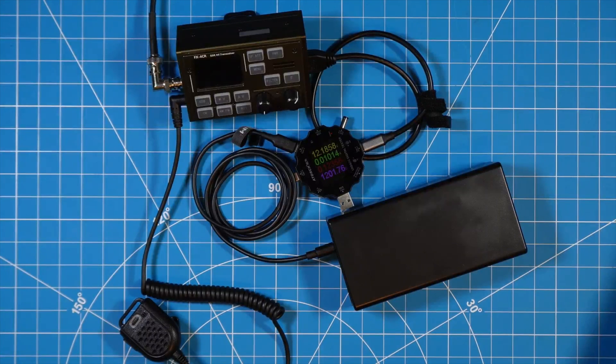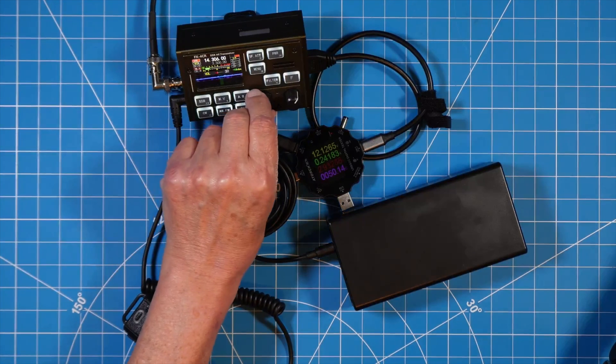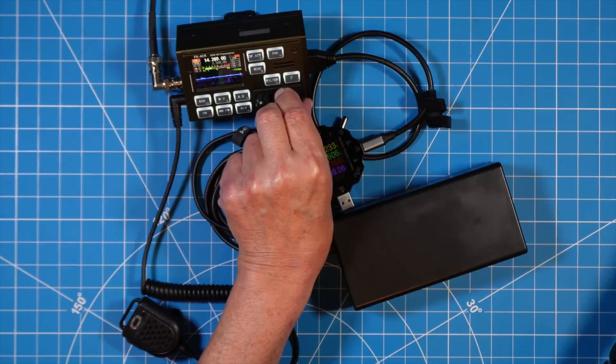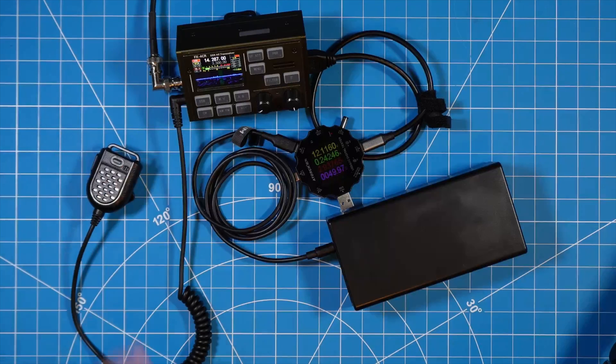I can't think of a better device to demonstrate the battery than the FX-4CR. Before we turn on the power to the transceiver, we're showing 12.18 volts on the meter and 0.05 amps. Once we turn it on, we are drawing 0.24 amps receive only, and once we find a clear frequency, we'll just do a test transmission. You're going to see the amp draw fluctuate with my voice — that's the nature of single sideband — and the max we hit is 1.36 amps. In transmission the max I pulled was 1.36 amps, and receive only we were pulling 0.24 amps. When I was doing the drawdown on the battery, I drew it down at 2 amps consistently, and that took more than six and a half hours to pull it down, meaning if you're using this with a QRP rig, it's going to outlast you.